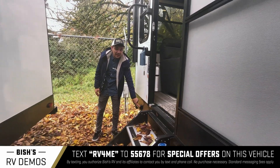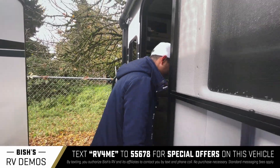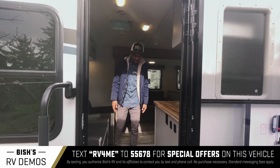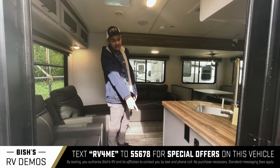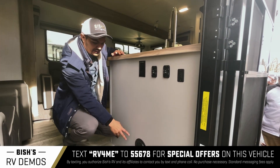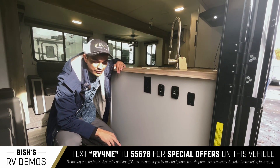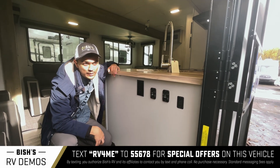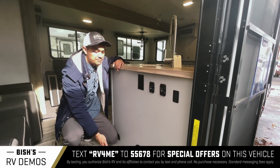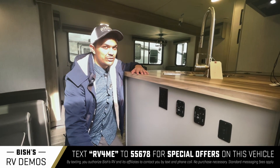There's another set of jacks in the back, and making our way right up into the room you can see we've got the nice solid steps coming right in. You've got the side-mounted heat duct. It's better on the side because when they're in the ground you're constantly having to clean them out. It's also hard to pull them out since they screw them in — there's no quick way to do that like there is at your house. So the side mount is better.